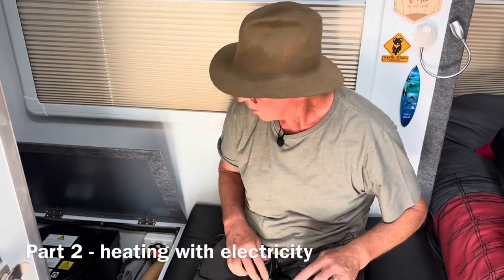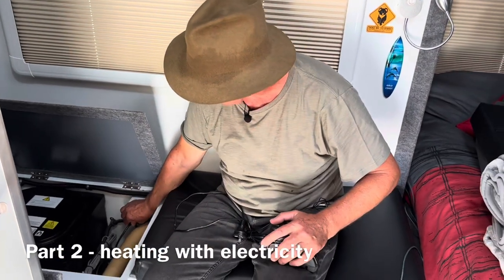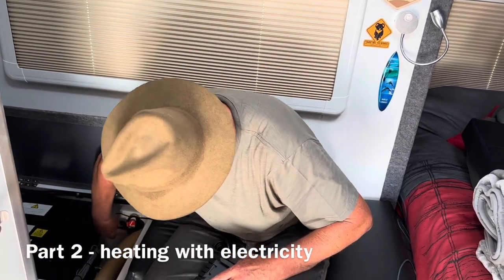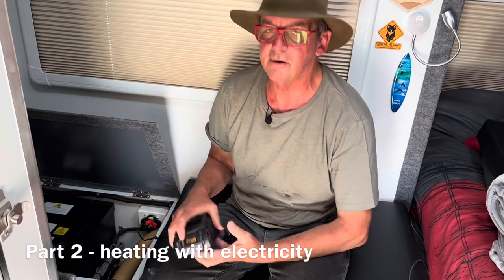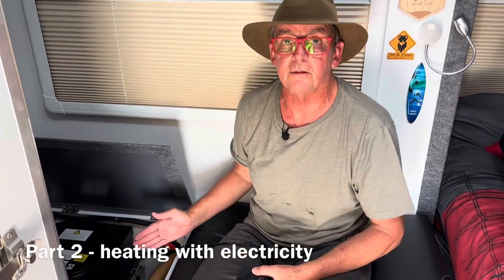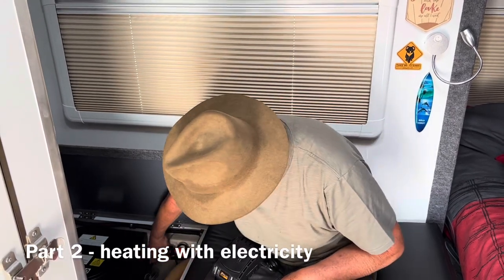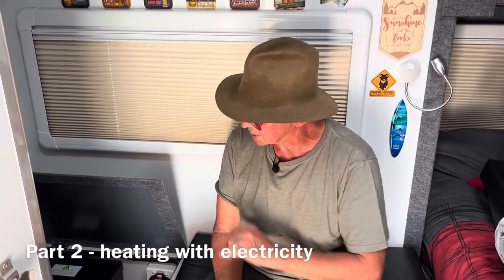— by plugging something else in, or you don't have the heater full of water and the thermostat would have shut down. So we'll turn the power point off, unplug our hot water heater, plug in another device that we know works — this is my battery charger for my power drills — turn on the power point, and that reveals we have no 240 volt power. When you run this system on 240 volt you don't need your gas turned on or your 12 volt turned on — you only have to plug it into a working outlet.